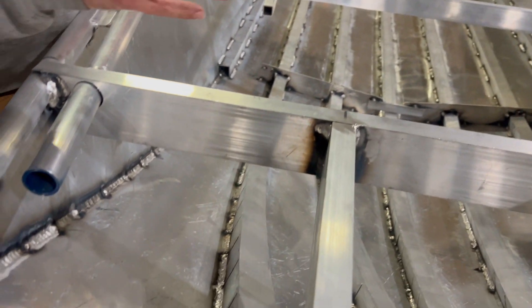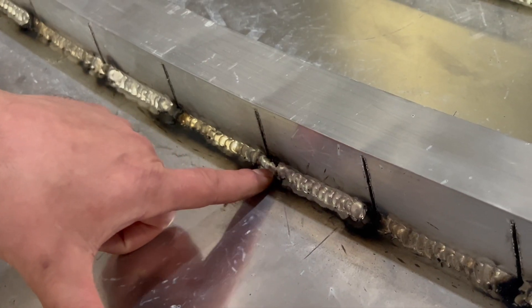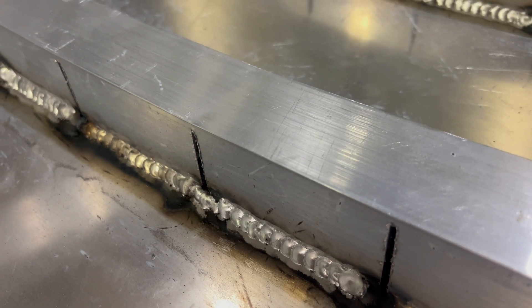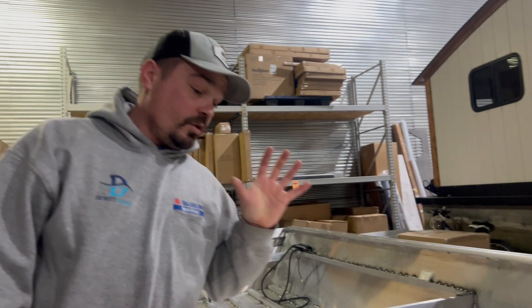So far I've used the pulse welder from Yes Welder quite a bit on this boat — I did pretty much all of my tacking with it. The big thing I wanted to improve on my boat builds with MIG was getting longer welds and prettier welds underneath the boat, underneath the deck — stuff you'll never even see. But the way I was able to lay in some really nice-looking MIG welds with that pulse, I've been really happy with that. Usually I would be running my spool gun and it would be super inconsistent. There's a lot of good heat transfer through on all those welds, so that's what I've used it for application-wise.